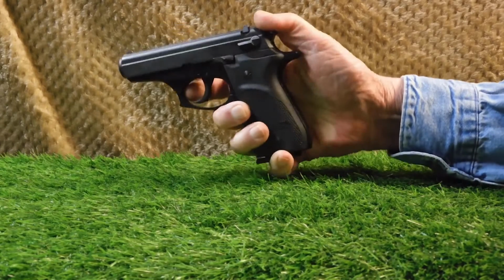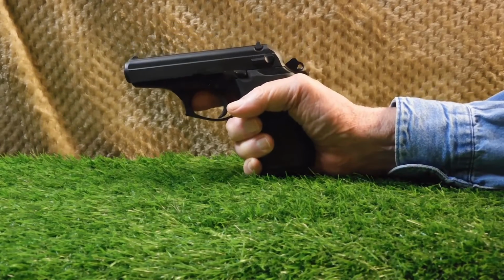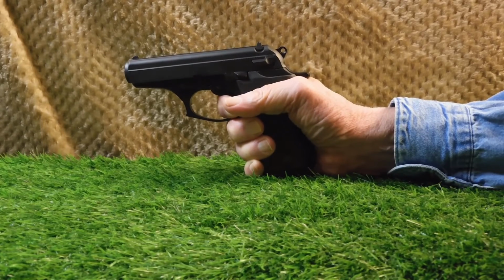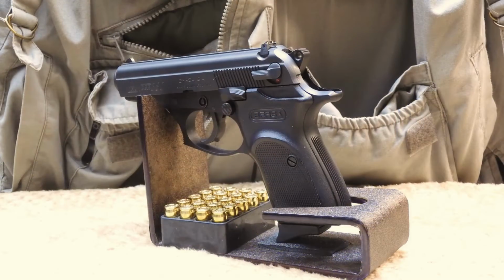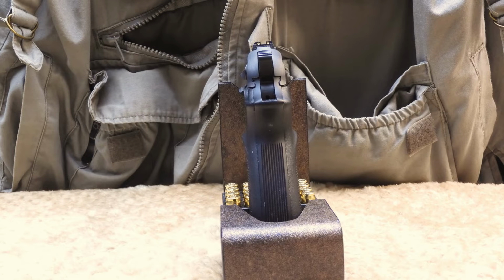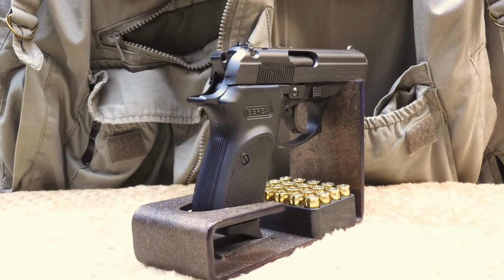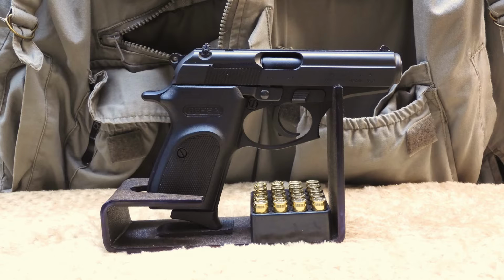Personally, and with the Bersa 380, I prefer the tried-and-true decocking method that I have used for many years with the 1911 pistol, rather than use the safety decocking mechanism. Note that even if you manually decock the pistol, the hammer does not rest against the firing pin, ensuring that the hammer does not fire the pistol even when dropped on the hammer. Essentially, the hammer is positioned at the same place when the safety decocking lever is placed in the safe or decock position. As I mentioned, when I carry the Bersa, the hammer is lowered manually with a round chambered, and the pistol in the fire mode.